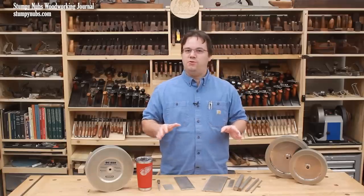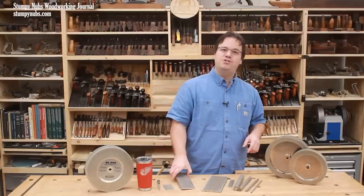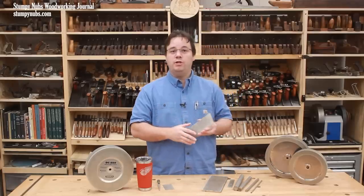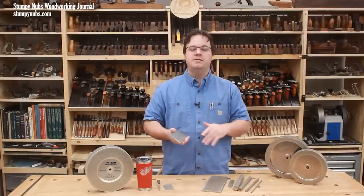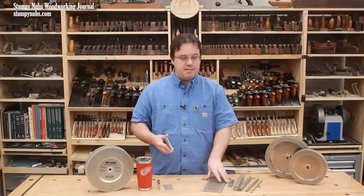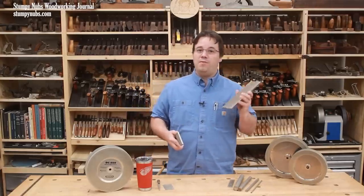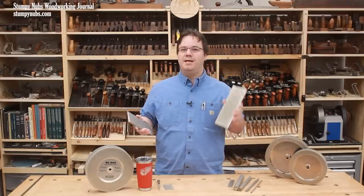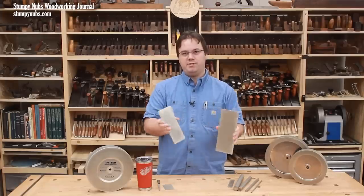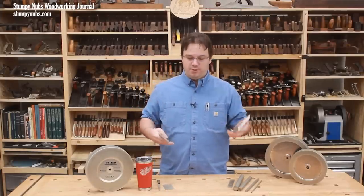So let's bottom line this for the average woodworker that's watching this. If you sharpen by hand, diamond bench stones can last longer than CBN if you don't abuse them. Your stone can also be used to sharpen your carbide cutters, such as you might find on turning tools or even helical head jointers and planers. CBN stones can't be used to sharpen carbide, but they're still very durable, and while they may not last as long as a diamond stone, CBN-coated stones can be significantly less expensive per square inch compared to diamond stones. So in my opinion, it's really a trade-off between the price of the stone and the life you might expect from it.